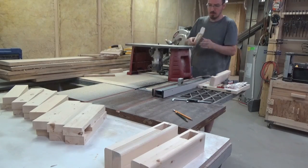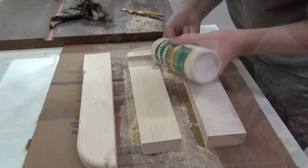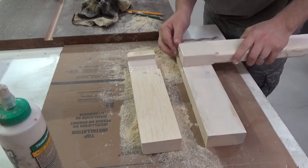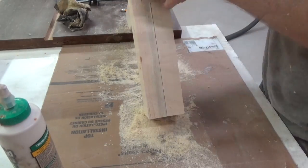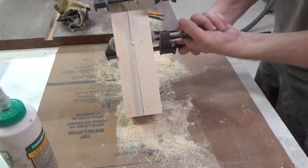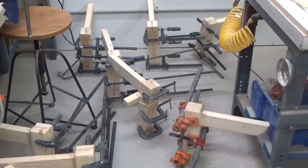While I had the router table handy, I rounded over the front edges of the uprights so that they're just a bit more friendly to the touch. Now we're ready for glue up. I used Titebond 3 because it has the strongest bonding strength of all the Titebonds and it also allows for a longer setup time if I need to make any adjustments. I smeared a liberal amount all throughout the mortise, across one of the inner faces, and then all around the tenon. Then I mashed it all together and started putting on clamps. After doing this ten times over, I used almost every single clamp that I own. I really have too many clamps — said no one ever.